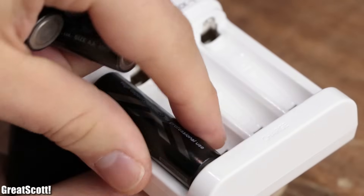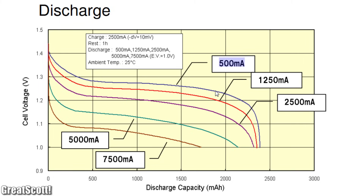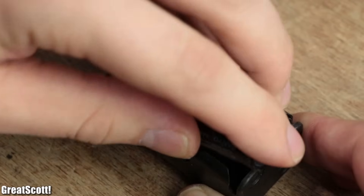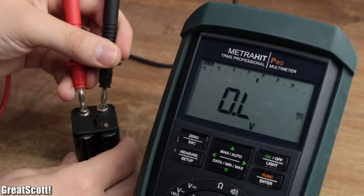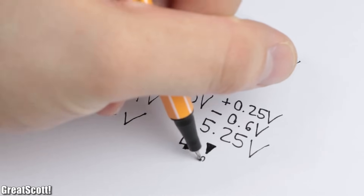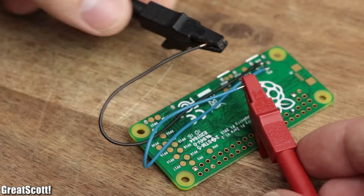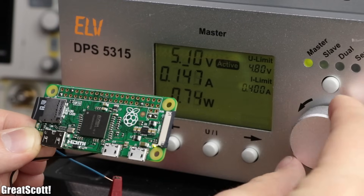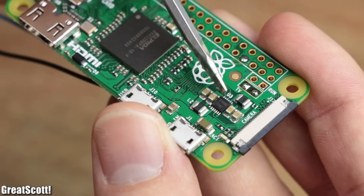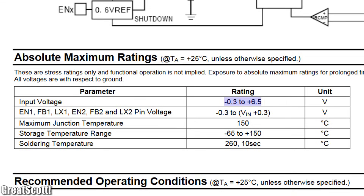When fully charged, those batteries have a voltage of roughly 1.4V, and will be almost completely discharged at a voltage of 1.2V. Since all of them are placed in series, we are basically working with voltages between 5.7V and 4.8V, which does partly exceed the USB standard voltage. So I connected the Raspberry Pi to my lab bench power supply to check whether it would work correctly with the given voltage range — which it did, because the utilized DC-DC converter, the PAM2306, works with a maximum voltage of 6.5V.